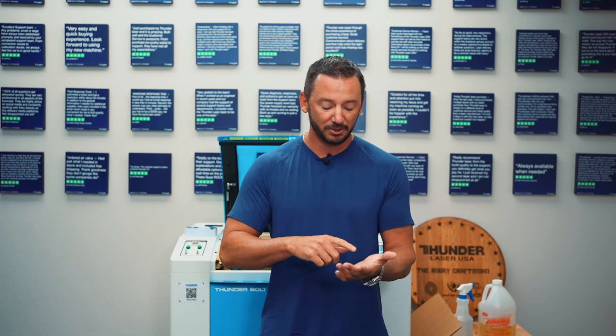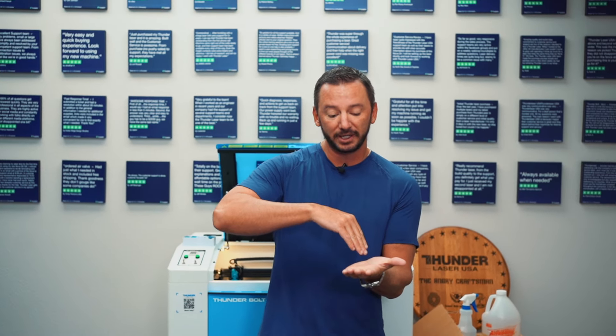There's not really any perfect settings for now. When we get into some more specialty materials, you'll need to dial those settings in a bit more. But for basic things like wood and acrylic, it's kind of preference — how deep do you want to engrave? Me and Grant were talking yesterday and he said he likes his acrylic engraving really smooth, just brushing the top of the surface with the laser, whereas some people might like a deeper engraving. Or if you're gonna paint the acrylic, you might want that deeper notch. So don't be afraid to play with it.